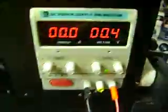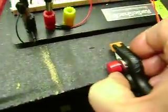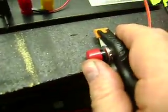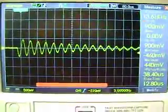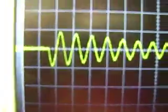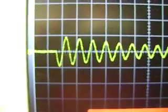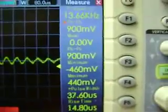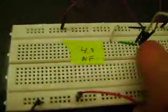Now, when I'm at 0.5 volts and I flick this switch and close it, charge this up, and then I release it with my thumbnail, letting that spring jump it out, it shows, let's see, flick it, a very consistent waveform. There's nothing really crazy going on at the beginning of it. I mean, you'd think that there might be some sparking, but there's not, and it's most likely because it's low voltage. Our output, or peak to peak, is like less than a volt. So that's with the bifilar coil.